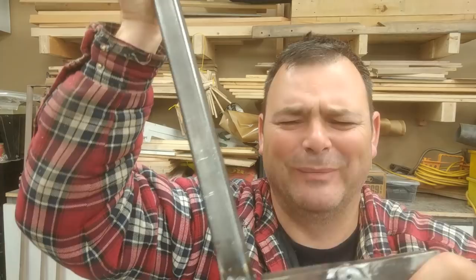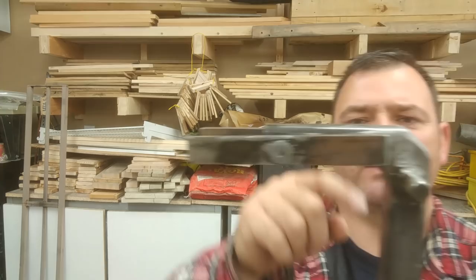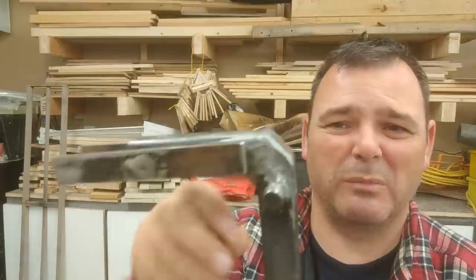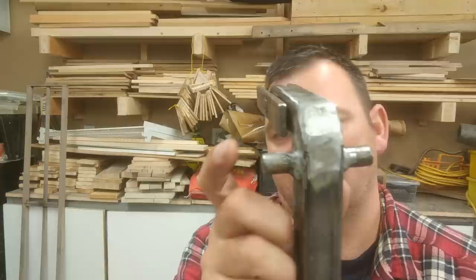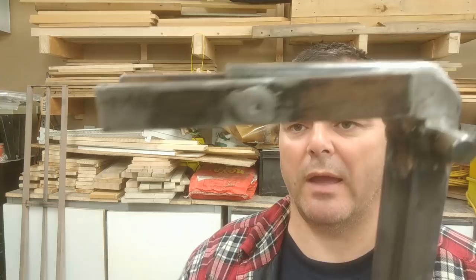Let's talk about this power breaker bar — it worked awesome. The five-and-a-half-inch pieces of wood didn't crack; it just broke through the nails. What made it easy is the location of this pin — it has to be as close as possible to this arm. The bigger the pin, the less damage it creates to the wood. I'd have made it a little longer, so eventually I think I'll remove it, rebore the hole, and put in a bigger pin.